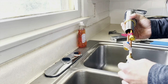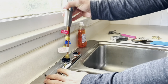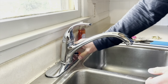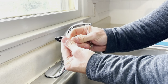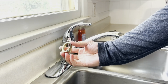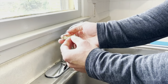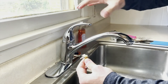Most of the faucet installation is done from underneath the sink. So you just place the bottom plate right here and drop the faucet down through, and it will seat down onto that base plate. And then we'll be attaching the bottom on. There is a rubber gasket, a metal gasket, and they kind of hook together. And then this large nut will screw on there. You want to loosen these Phillips head screws up first, and then you screw this part up underneath there, and then you can go around and tighten the Phillips head screws individually to get it mounted straight.